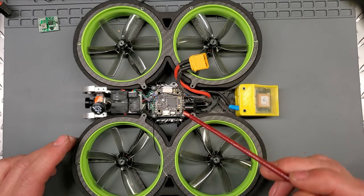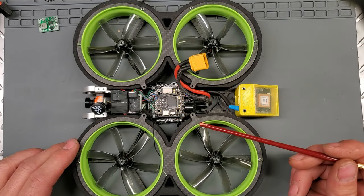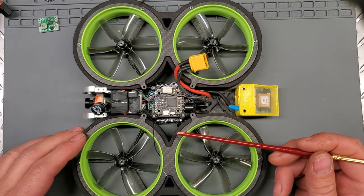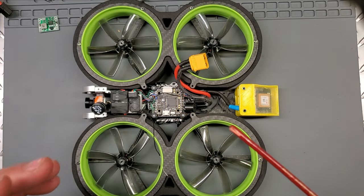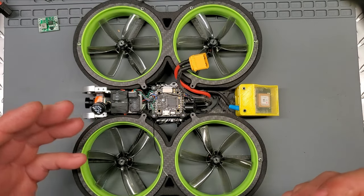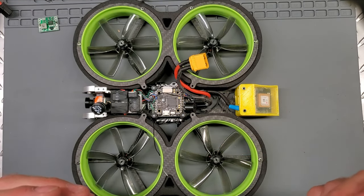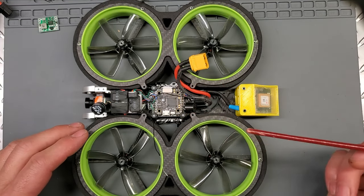Now, BillyD60, luckily, I didn't know he did this, but luckily he used a really good flight controller. This is a Matek. This is the 722 Mini, so it's an F7. It's got plenty of processing power for INav, which is very, very important. Also really important is that INav has a target for this. That's something you have to pay attention to. You can't just get any willy-nilly flight controller out there. You have to make sure INav has a target for it, okay? So go to INav's page, and they'll show you the ones that they can support. This happens to be one of them.